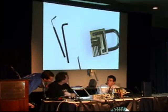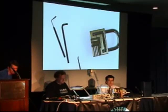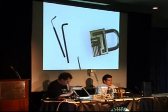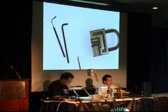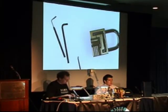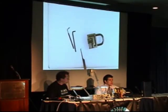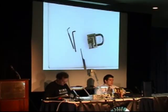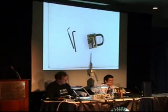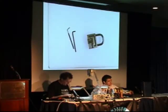What you're saying basically is, from what I understand, because of mechanical imperfection in the manufacturing process, since you can't make it perfect, is why lockpicking is possible. Since pins aren't exactly perfectly inside the channels, they have a little bit of play. The more play, the easier to pick, as a general rule. If it's very, very tightly manufactured, it's going to be very hard to pick. Because they can slightly cock and slightly move, you can catch right that shear line, put tension there, and catch that shear line. That's what picking is all about. Then you have to do one pin, another pin, etc., so you run out of pins and the lock opens.